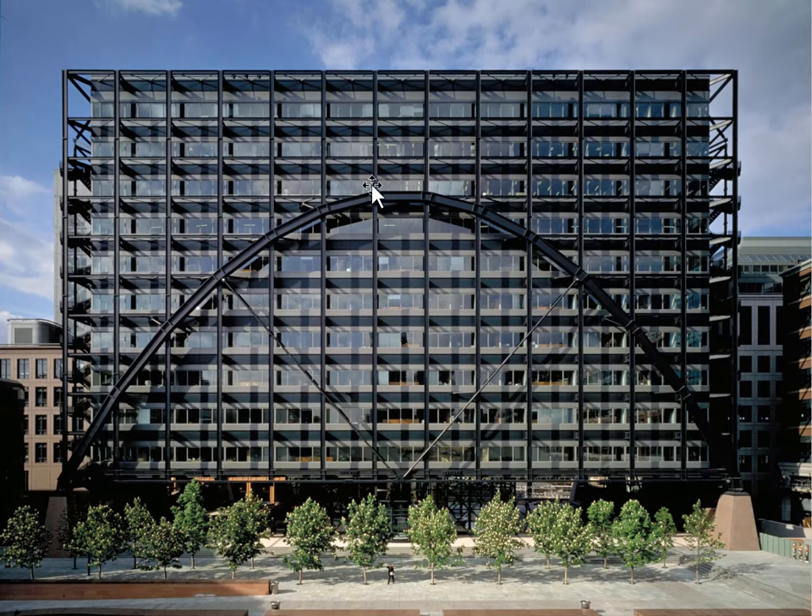The parabolic arches of the Broadgate Exchange House — one on each face and two in the interior — are fairly thin, with a substantial tendency to buckle laterally. However, on the other faces of the building there is extensive cross-bracing, and at every joint the arches connect back into the floor plate or floor structure. The bracing on each end keeps the floors from moving in and out, and that is what stabilizes these arches laterally.